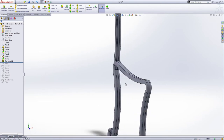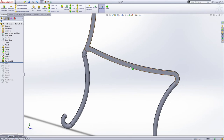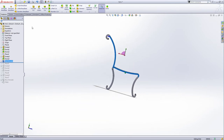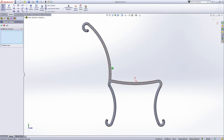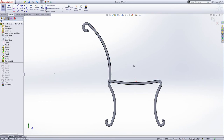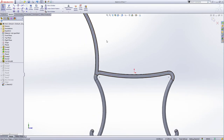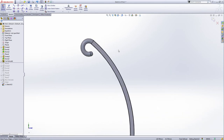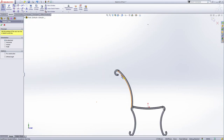After the cut, the inside face looks like this. We're going to draw some sketches on this plane and extrude — then we get the strips for the bench. Select this plane and make the extrude base. Use convert entity — convert entity and select this face, green check. The black line here is fully defined — it's the outer layer of this face. Now use the line to draw some strips — you can adjust the widths of the strips.